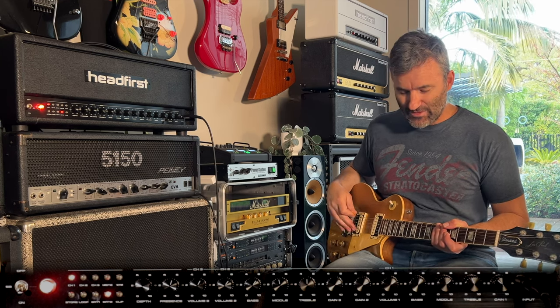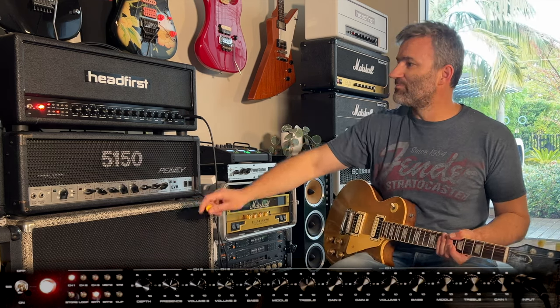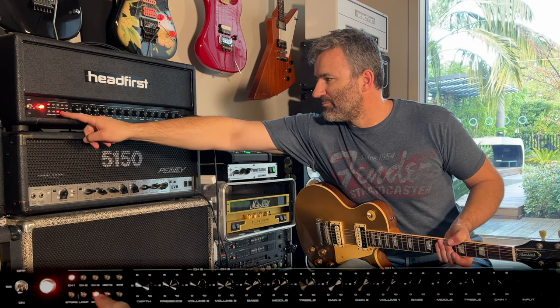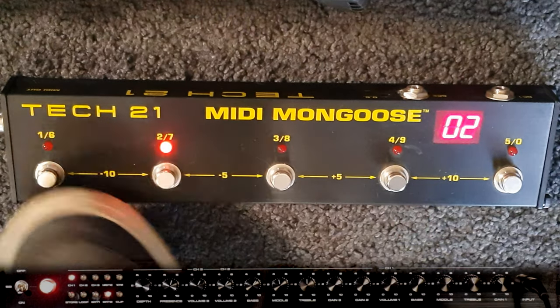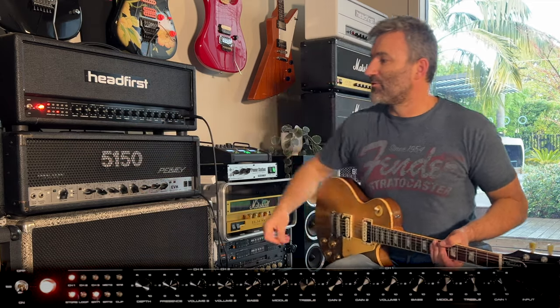All you need to do is send the MIDI program you want to work on to the amp. Let's hit slot one — now I'm back to program one MIDI. As soon as you send that to the amp, it recalls, but you can change it. Let's put this back to both bright caps on, press store, and now that's stored into the last program you sent the amp — in this case, one. Back to two, back to one. There it is. So simple.